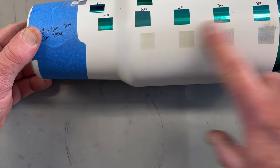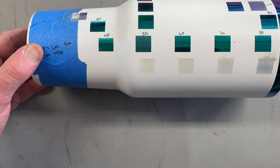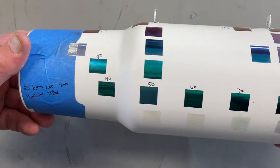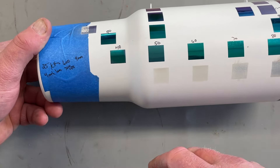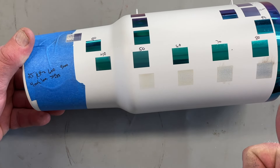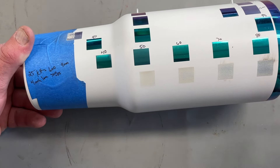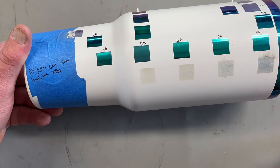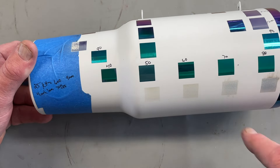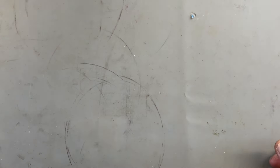This other test was a miserably failed attempt. We'll get into why you should not alter your beam combiner. Right now we're getting extremely positive results with the four-inch lens, nine millimeter focal distance logged in LightBurn, 500 lines per inch, 600 millimeters per second, and changing the kilohertz to 25.